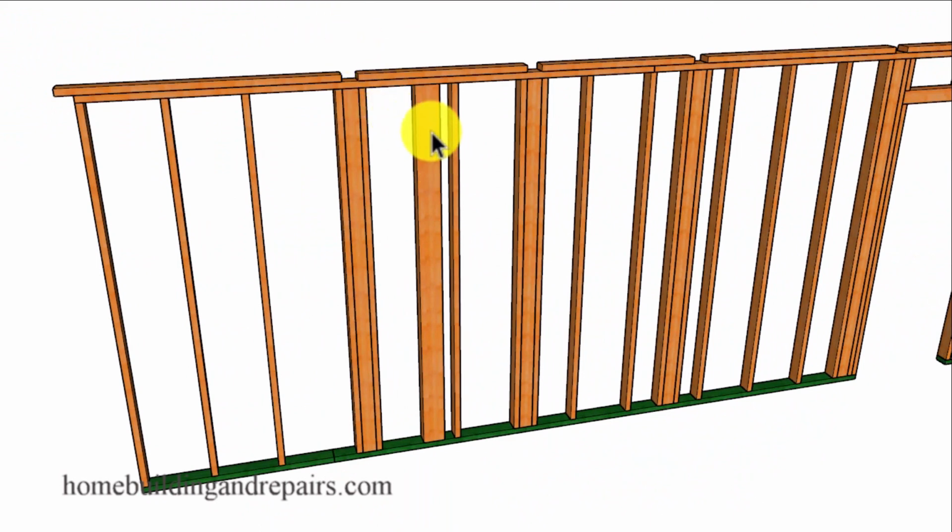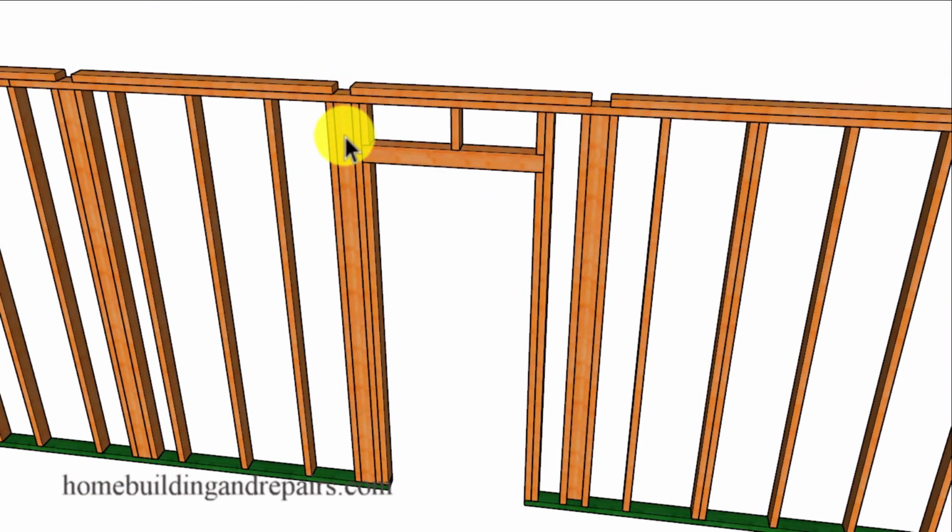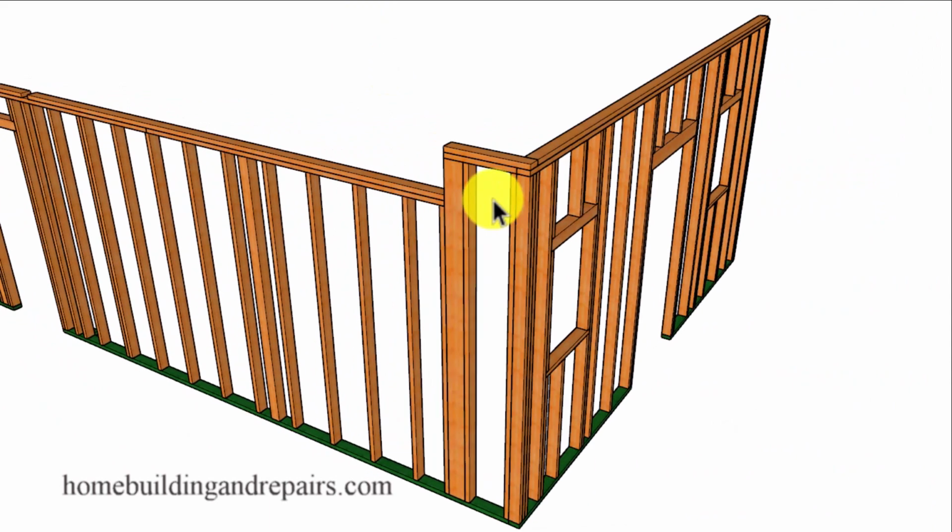And a large post. This post here is going to be supporting a lot of weight and will definitely require some type of a structural footing underneath it. And of course our channels here where we will be intersecting additional interior walls into this long wall.